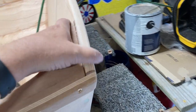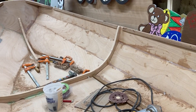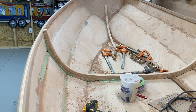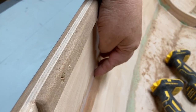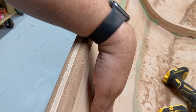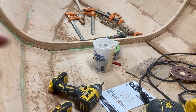Rounded the edges and corners along the gunnel, and we actually managed to get both sides done. Next we need to do some cleanup of this epoxy, a little bit of sanding, and some fairing. We've got a little bit of a feather edge on a plank here, and I'd rather just go ahead and fair it in so that any water running down just keeps going to the bilge. We've got a couple of limber holes there so water can flow back and forth.